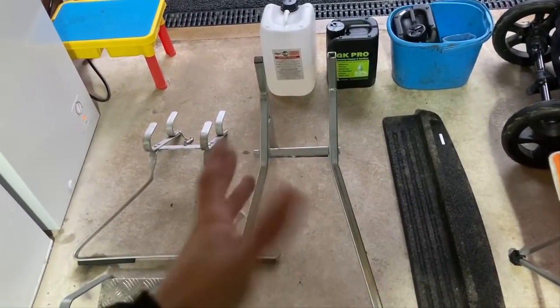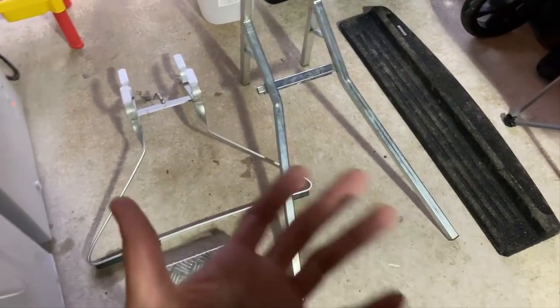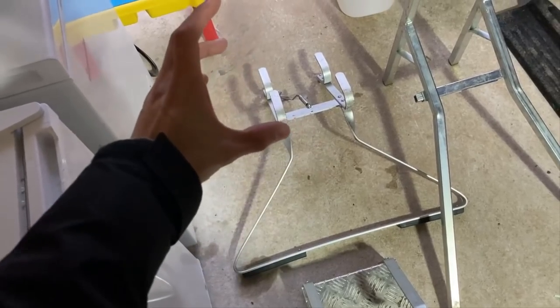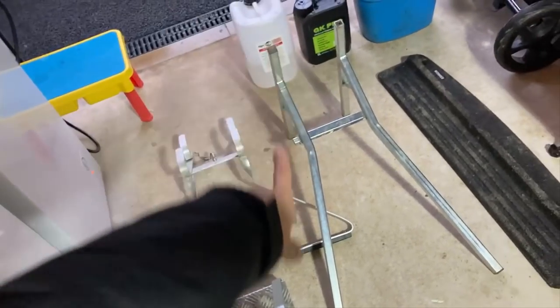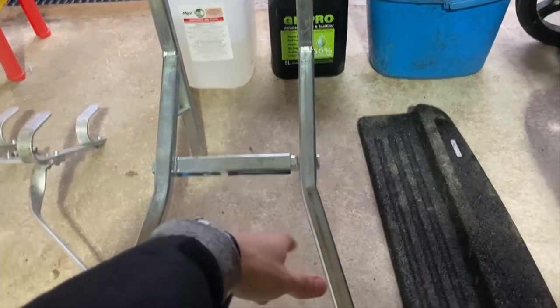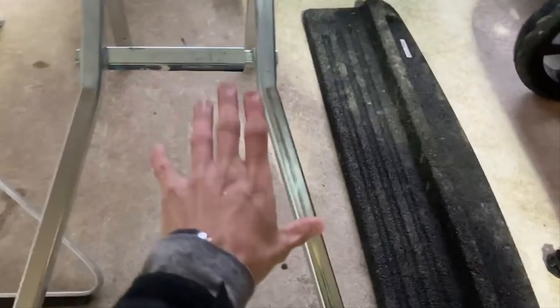For ladder equipment: if you're going to be on ladders — like tomorrow's job where I have no choice and nowhere to put a scaffold tower — a ladder standoff is very important. I recommend the Micro Light one, which has wheels that flatten under pressure. I also use Ladder Mates: they extend and clip into the bottom rung as a stabilizer, and they go low enough to handle a step drop below the ladder feet.